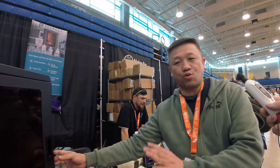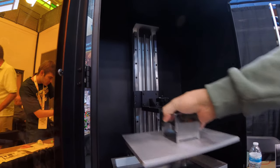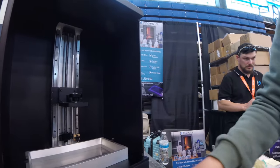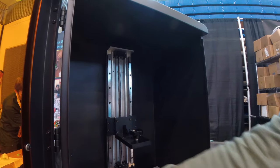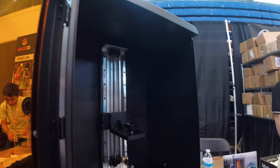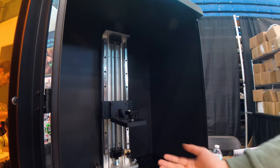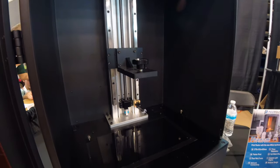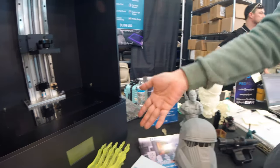So let me just give you a quick overview. You can see the dual-linear rail here, the big build plate, a very large VAT system here. And if you look underneath the VAT system, you can see the LCD panel right underneath. The UV LED lights are right underneath. The light comes up, the panel will filter and display an image in UV light. Then the resin will form based on that image. That's how you print one layer. Then you move to the next layer and follow through and you get a beautiful plate like this.